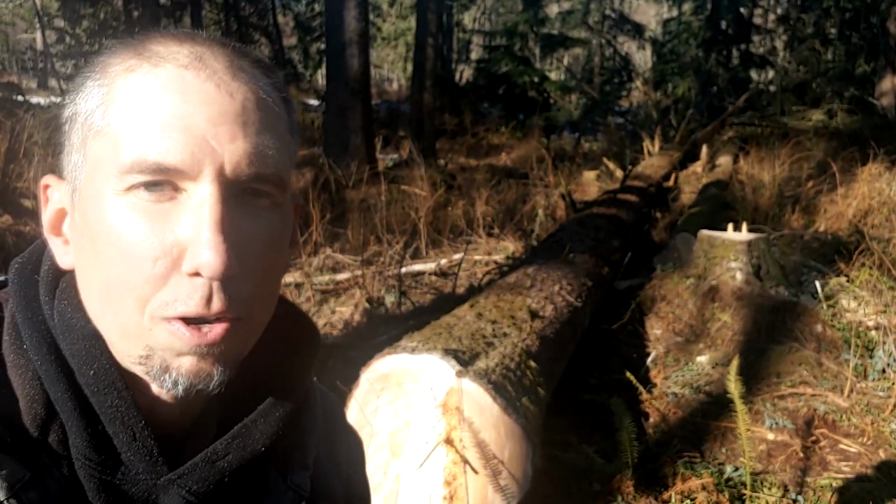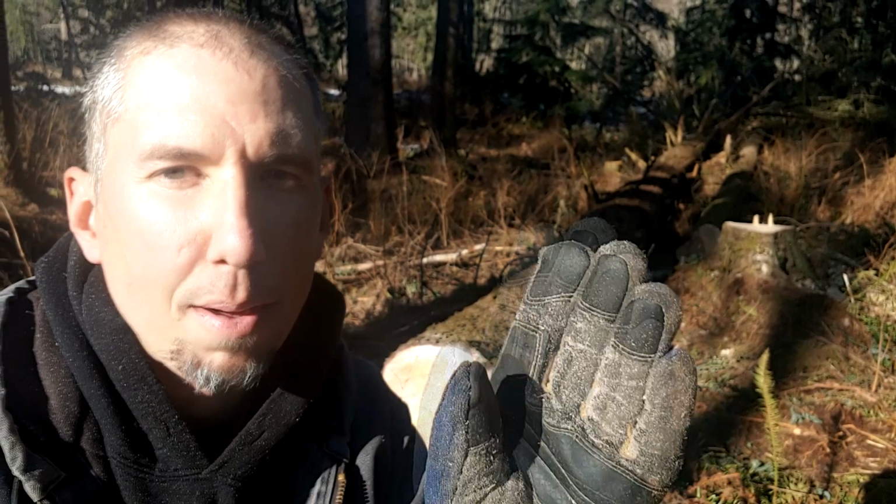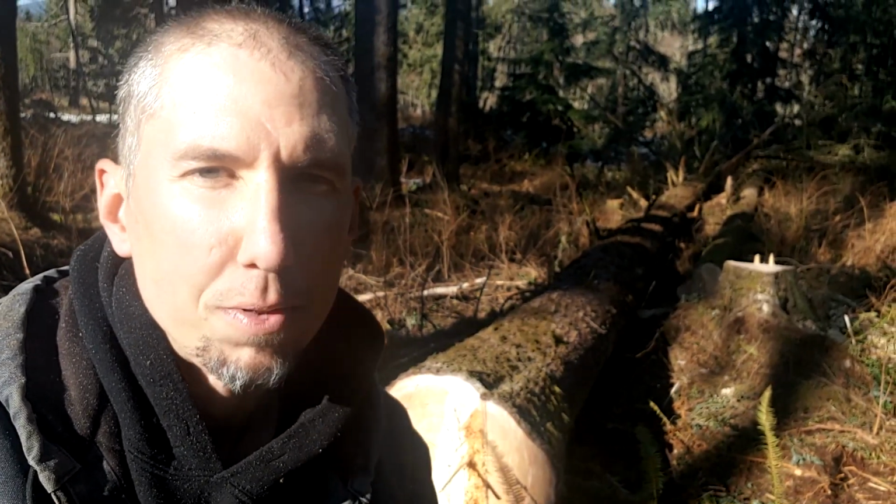But I just measured that spruce. That big one there is 40 inches across the butt, and my mill's absolute max will take 40 inches at the butt. So I'm gonna prune off a little bit on that one and get it down to like 38. There's a little bit of butt swell on it, and I'm just gonna cut off a little section of the butt there on the sides so it'll fit in their saw. But we'll get it limbed up here, and I'll see if my skidder can pull this.